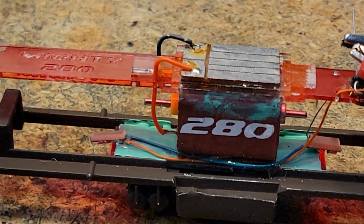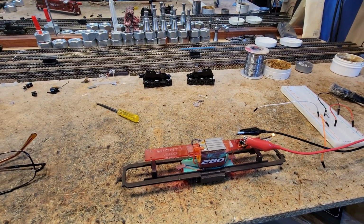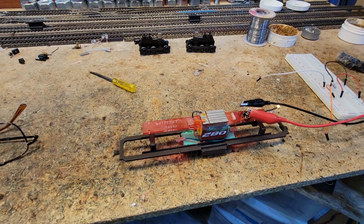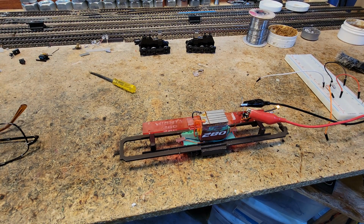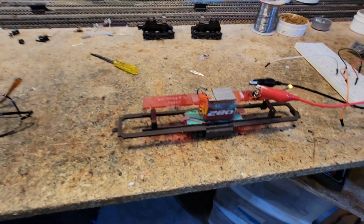So then we're going to use a DH126 Digitrax, and that will be pretty sweet. It'll sit right here. Wires will go here, and we'll send up to the top the white wire for the headlights. All the lights are going to be just on, off, all of them. And then we're going to do a beacon because we only got 2 functions. And then some constant lights. And we're going to put a capacitor on there too to give it a nice smooth lighting.